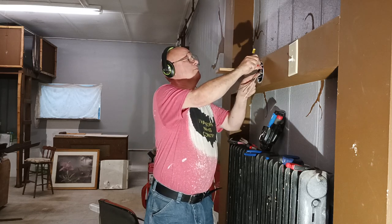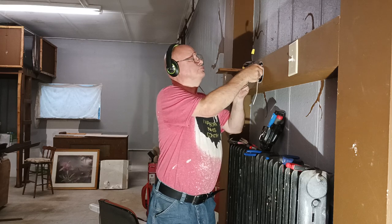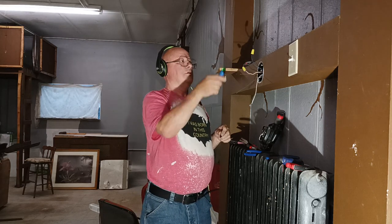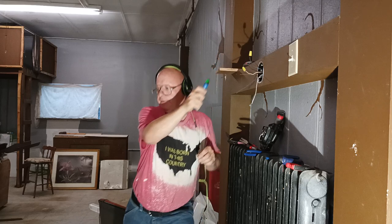We can get back into our box. Now we have this, our black wire, which is live here, so we're going to go shut the breakers off.